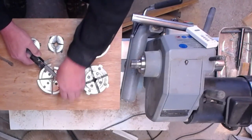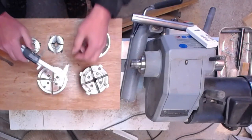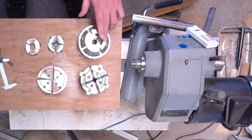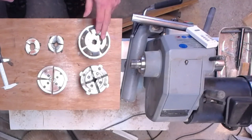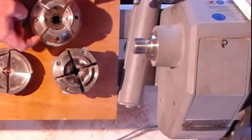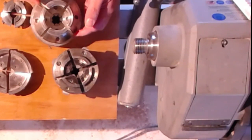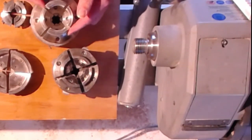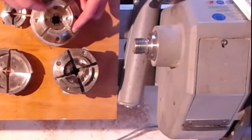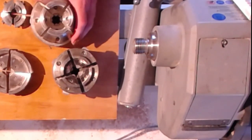This video was made in answer to a question on the Facebook group, Wood Turning for Beginners, regarding getting the right sized tenon to fit the chuck. This is the range of chuck jaws that Pete regularly uses. The exact specification for your chuck and jaw combination can usually be found from the manufacturer. Alternatively, put them on the chuck and get the best circle by eye.